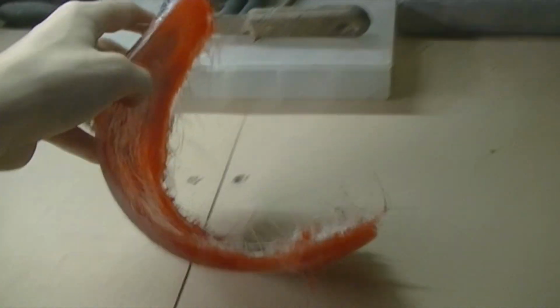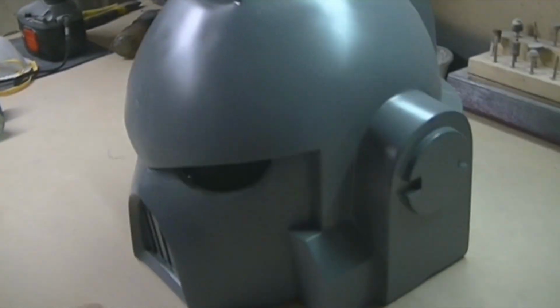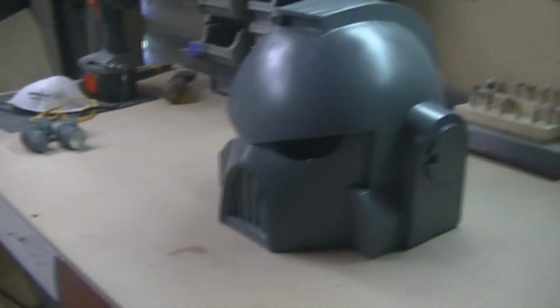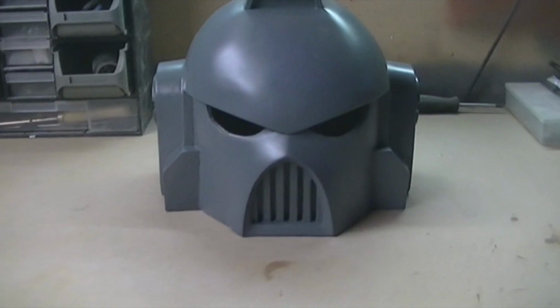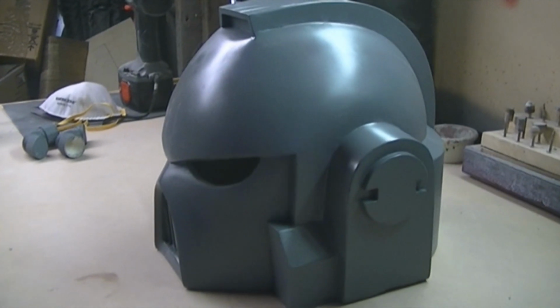this is one with fiberglass, with only a layer and a half, probably two layers, and as you can see, it's barely bending at all. So it's a lot tougher, just for an open flat area. So yeah, that's what I'll be doing, casting all these in fiberglass, just so it gets a bit more strength to it, and it'll also be a bit lighter. So yeah, just a little update, and I'll be back once I have this guy moulded, which should be after my New Year's video.